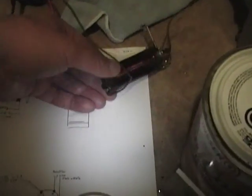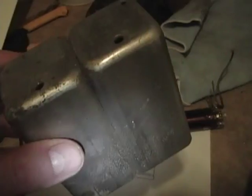Alright, that worked out quite well. It's a plastic collar embedded in some shellac, and then I wrapped about 7 turns around, just as indicated, and I even put a notch in the plastic collar like the original had and looped the wire around. So it starts here on that grounding lug and goes around about 7.5 turns, and then terminates on that lead. Just need to solder it on and trim off the excess. Then I will remount this and be sure to put the shields back on so those 2 coils do not get damaged while I continue working on the radio.